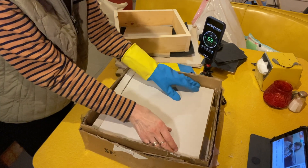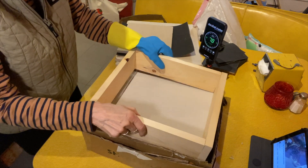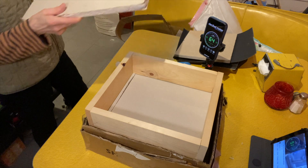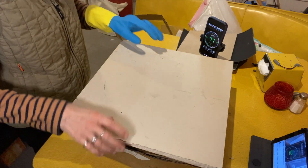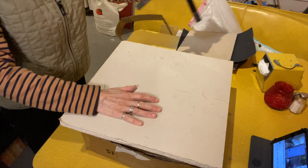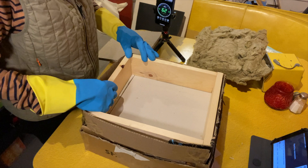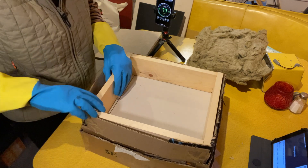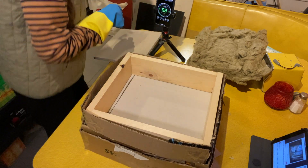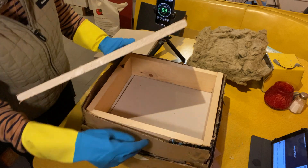You don't have any control over their walls or their ceiling. This next layer of wood frame represents the empty space between your apartments — it could be a wall space or a ceiling cavity. And then this piece of drywall represents the wall inside your home, or it could be your floor if you have a downstairs neighbor. Because a lot of flanking noise sneaks out through these wood frames, I've tried putting cardboard around them on the outside, which is not as effective as drywall. This model isn't to scale — the depth of this wall would be bigger in reality.